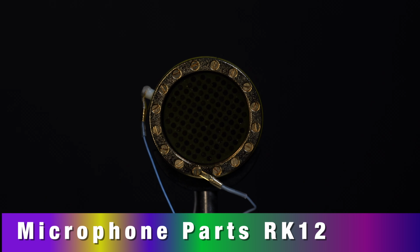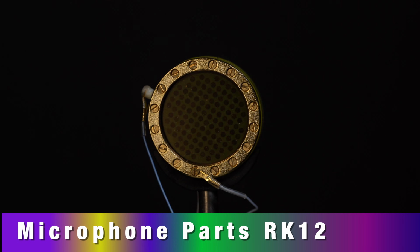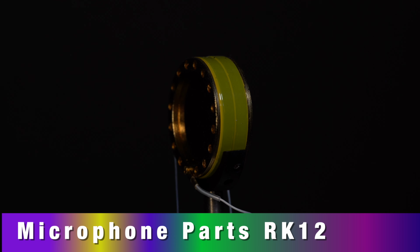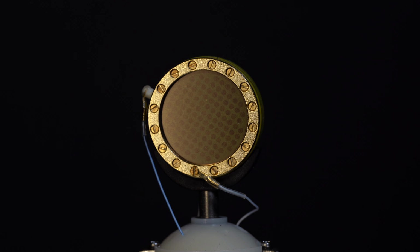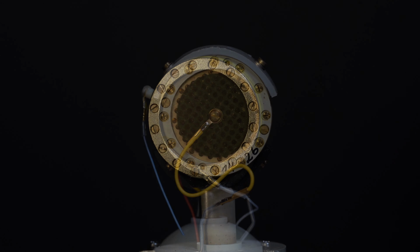This one is edge terminated, meaning that the signal is taken from the edge and that the diaphragm material is conductive all the way across the film. This design first showed up in 1951. These are from my first real mic build, and I have a matched pair of them. They both use FET electronics for mic parts, and I run them on 75 volt DC bias voltage.